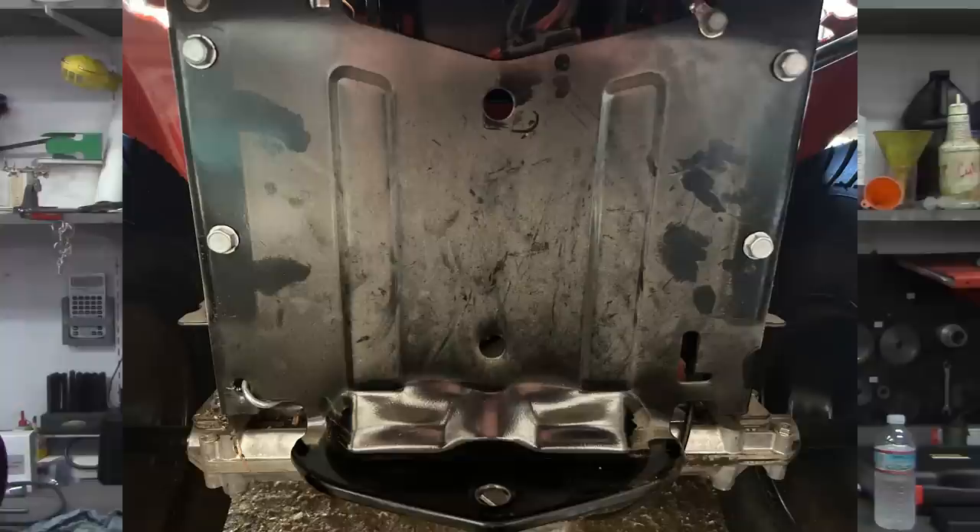Here's a picture of the back of the mower. As you can see toward the bottom of this picture, the lip that's turned out — and the hole in this is only five eighths of an inch. So even an inch and seven eighths ball, which has a three quarter inch pin or shaft, will not fit in that. Plus the hole is up very tight to the frame. The second problem is the height of that hole — it's only about 10 inches off the ground, and we really need to get up about another two and a half to three inches higher.